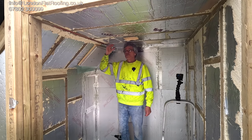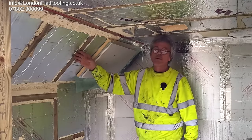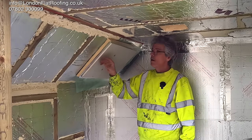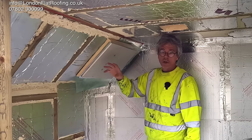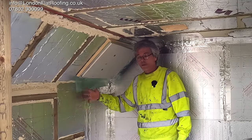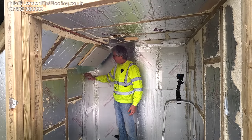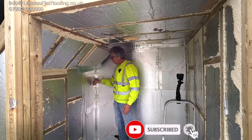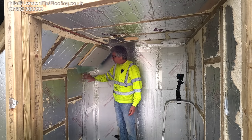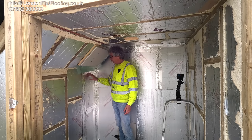Well, we've now seen the thermal loss through this. So generally speaking, what they want now — and it's a really good thing to have — is more insulation put over the top of this. This stops the thermal bridging through the timber work of your stud work all the way through. The thickness of that will depend on what you've got on your drawings; generally these days it's 25 or 50mm insulation. It does depend on how much insulation you've got between the joists as to how much they want over the top to stop this thermal bridging. The most important thing is to make sure that the vapour barrier is continuous and airtight all the way around. You don't want to be relying on this silver foil. I've put the silver foil on here to show you that you can go around and repair where all of this has been broken off — that's a good thing to do because the insulation here has a quality where this silver foil is reflecting the heat back in, and by cutting it away some of that quality has been lost. But you don't want to be relying on it as a vapour barrier.